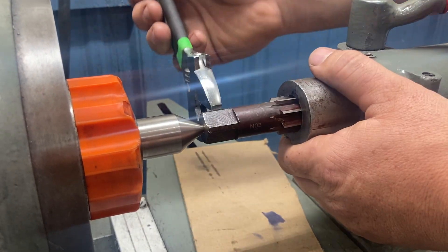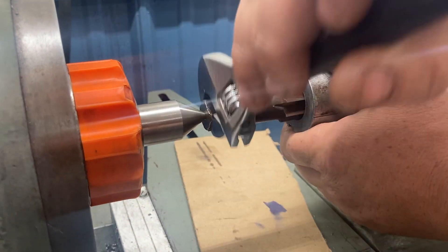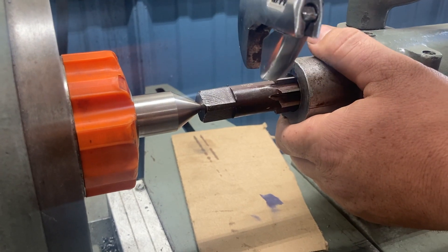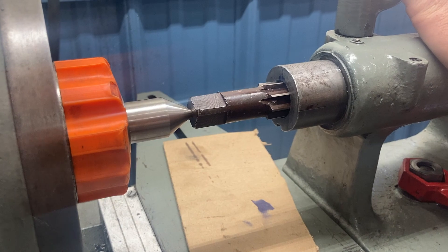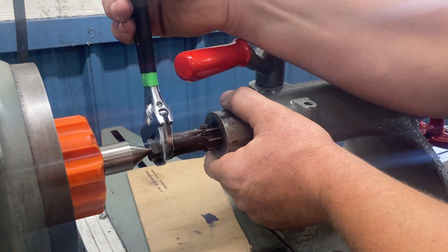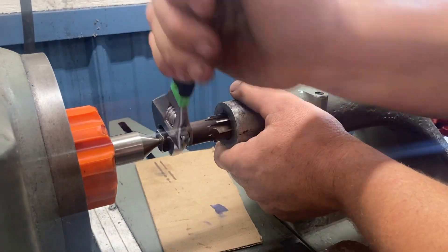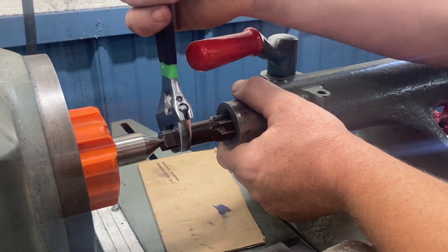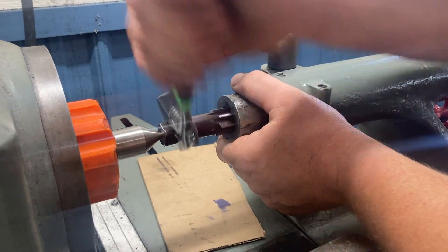What I'm going to do is just keep turning. Notice I'm not having to use much strength at all, which is good — I'm not trying to force the reamer in any direction. I just add a little bit of tension and lock the quill. Now it's a little bit tighter, but still I'm not exerting a lot of force. I'm going to continue to do this probably for quite some time, because this tailstock has worn a lot more than I anticipated.